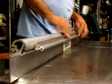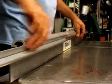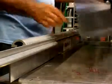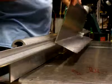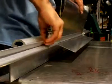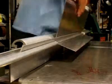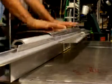In this step, we have cut the J die in half. Separate the J dies and install the L shim in the loop of the J die. Now we can bend a long flange on an outside radius bend. You are limited to .040 aluminum and 3 feet long for this bend on the 5-foot model. Simply install the material between the J dies and slide the L shim over to lock it in place. Then pull your radius as needed. Reverse steps to remove metal from the die.